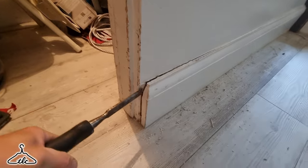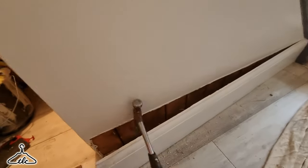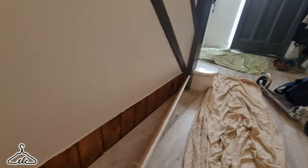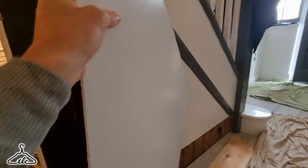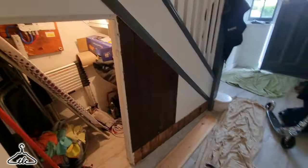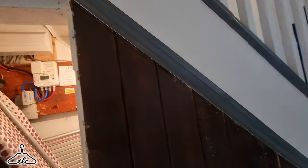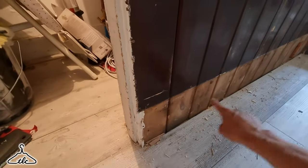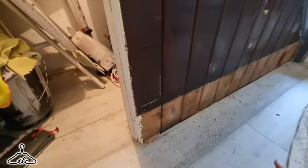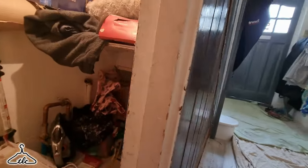Just going to carry on and take that off with the chisel - it's just nailed on. That's exactly what I wanted - a nice clean break. These boards are running past the floor down, otherwise I would have just levered them up from the bottom. So I'm going to make a quick cut, maybe about 50-100mm high. Sean's going to get the jigsaw and make a cut all the way down so we can just lever the boards up, get rid of all of this, and get back to the framework.